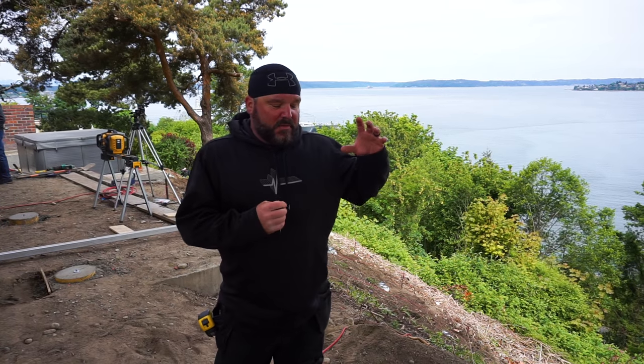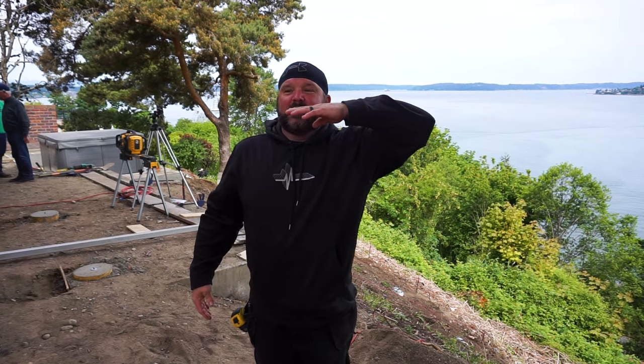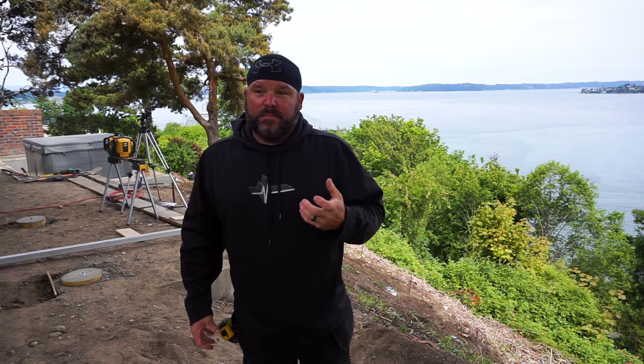Let's compare: if I was going to be using a standard footing on this hillside, they'd have to be 24 inches round and 5 feet deep — each one — and there are 10 of them. So that's like 10 yards of concrete we would have had to bring a concrete truck in and try to shuttle into these holes. It would have been a real challenge — a boom truck or something — very expensive. By using Diamond Piers, we're able to save a ton of money and a ton of time, and we can start building on these today. We're going to set some footings, put our post bases on, and start shooting up some lumber.